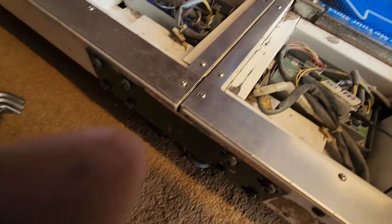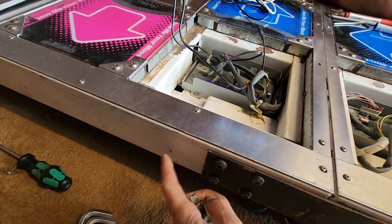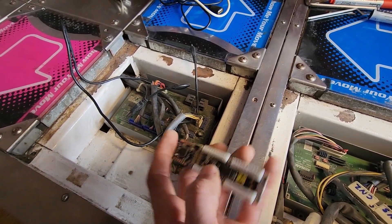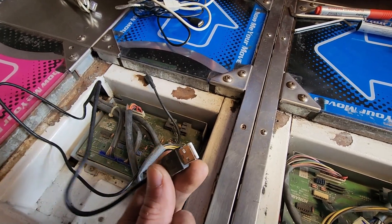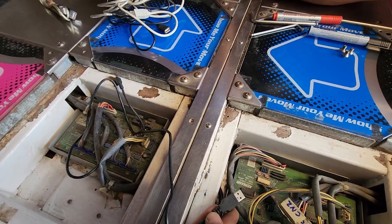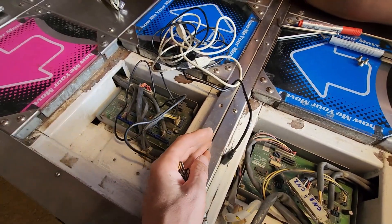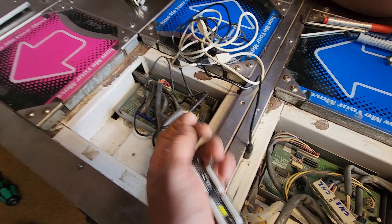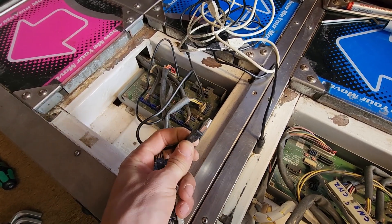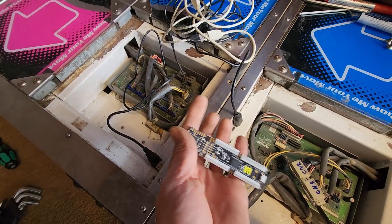With the other pad, there's an outlet on player one here but we don't have this outlet on player two. So if you have a two-pad setup, what I recommend is plugging in your micro USB here, and then having the connection somewhere around the middle — either here or just here. Then have a female socket right here as well, so when you split the pads in the future you don't have to unplug the card and get off the lid. So when you separate the pads, you can just disconnect at the split and leave the cards installed.